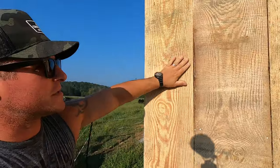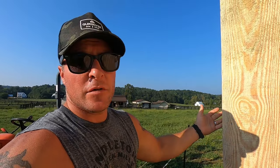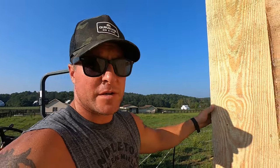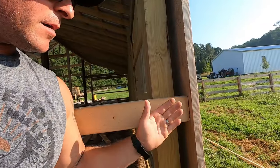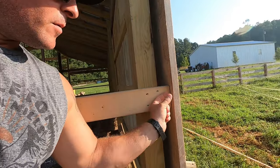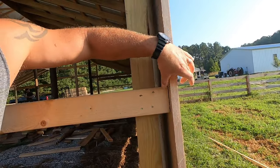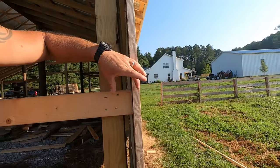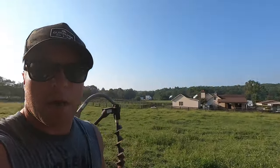We just finished up the back section, so now we have one whole side done. We stacked boards on there, nailed them up, used a level to check every third or fourth one to make sure we're staying on course. On the end I overhanging one inch on the back of the gable end — when I put my siding on it'll sit flush, and then we can add trim work: a 1x3 here and stacked 1x3 on the back side.